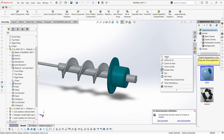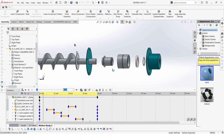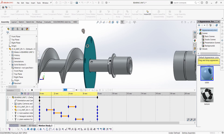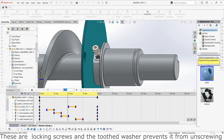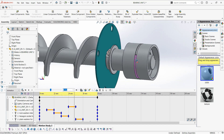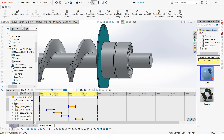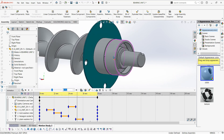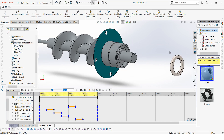Let's look at the bearings. This first one here is a bushing type — this is how it is assembled. Let's play this animation as I explain. From the animation you can see all the parts. This is our inner bushing — the inner part — which is locked or fixed on the shaft. We are using a nut to fix it with pressure. We also have the outer part of the bushing. The outer piece will just sit on the inner piece, in contact. On the outer part we have holes here, which are just for lubricating the bushing — the interface between the inner and outer.